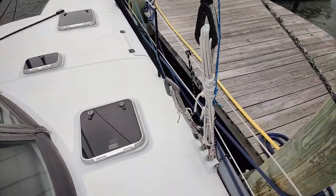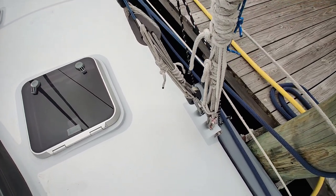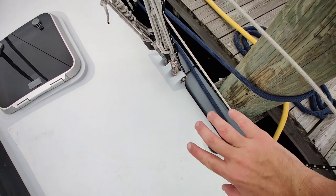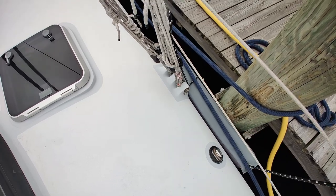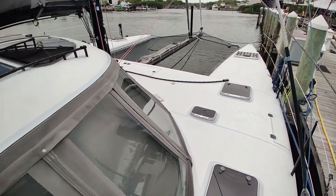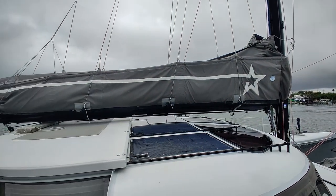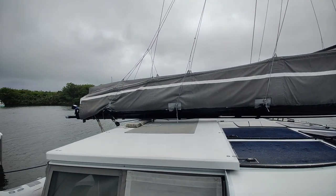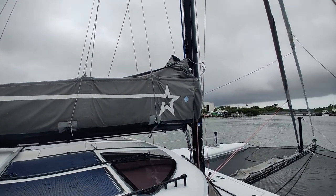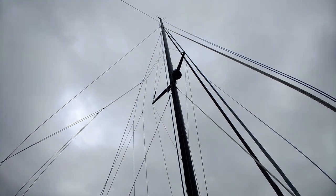You can adjust basically all the rigging just by adjusting the knots down here. The construction on this boat is composite construction, very lightweight. It's a rollover joint, so the deck is just molded to the rest of the side of the boat. You've got your chain plates right here. Most of the sails on this are North Sails 3DI — real great stuff, real interesting weave. It's a carbon rig and they definitely did not skimp on the height here. This boat is made for speed.